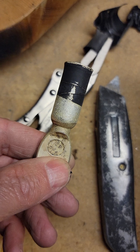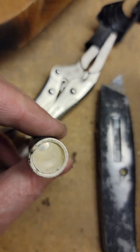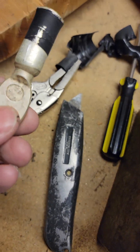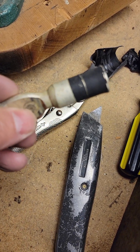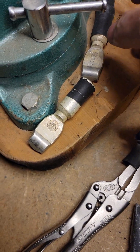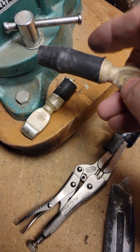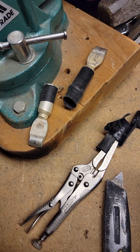I'll get my crimper out and try re-crimping this. This is definitely something I think folks should investigate — some wires can vibrate when there's a lot of amps coming in and off the batteries, and it wouldn't surprise me if these Anderson connectors just were not fully secured and we're not getting a very good connection. Anyway, that's it for this video.